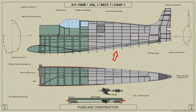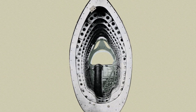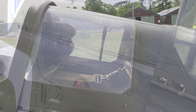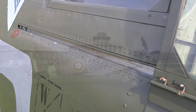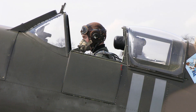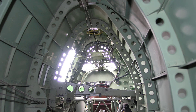The main fuselage portion extends from frame 11 to frame 19 and is shaped by hooped frames similar in shape but becoming smaller towards the rear of the aircraft. Between frames 11 and 12, the top portion of the fuselage skin is fitted with transparent material to afford a rearward view to the pilot. The sides of the fuselage below this portion are fitted with channel section runners for the cockpit sliding hood. On the starboard side the channel extends forwards along the top edge of the cockpit combing, and on the port side the forward portion of the channel is fitted in the top edge of the cockpit door. The top of the fuselage between frames 12 and 13 is braced laterally by diagonal members, and where they intersect a support is formed for the wireless aerial mast as shown here.